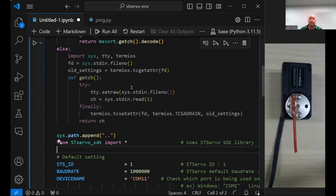So we'll leave that. The second code, is there an app to do that too, or? For Dynamixel, they do. For the cheap ones that haven't written the app yet, you write a little Python program. Okay, to swap it. Yeah, I'm skipping over a few of the things. Change the ID. Yeah, change the ID. It's not hard. It's much like CAN, you know, the same thing. You have CAN IDs, you have to set them all. Exactly. Remember, and write it down.